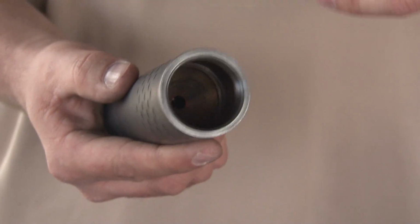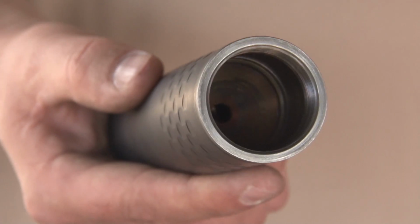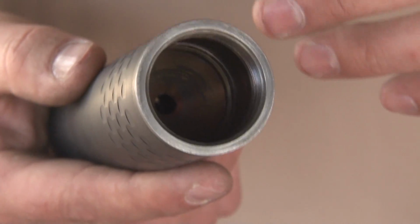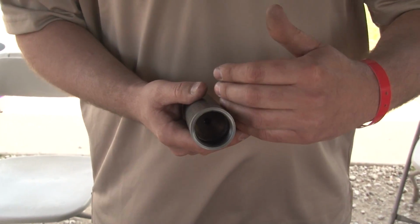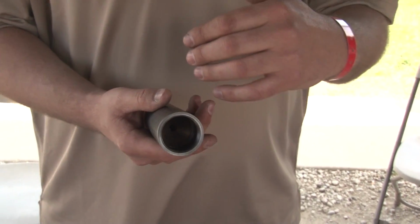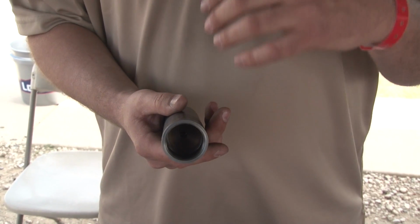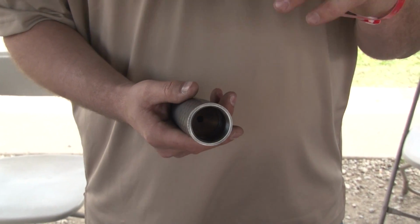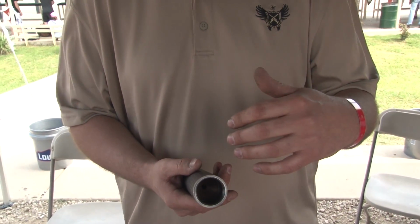And we thought we could do that one of two ways, or both. One was to find a newer, stronger material. The other was we thought we could make some improvements through improved geometry. So we did both. We changed the geometry. A typical blast baffle is a cone that faces the muzzle. This is sort of an inverse cone, so it goes the other way. We found through the geometry change, we were seeing up to a 60% improvement in erosion with a material that we knew would erode quickly, just straight stainless steel. We found similar performance to Inconel with stainless by the geometry change.